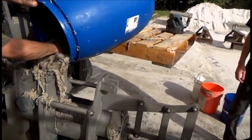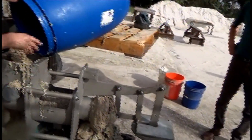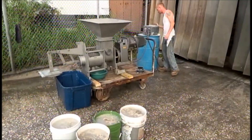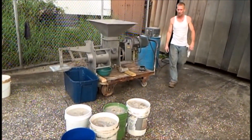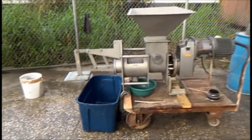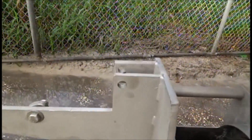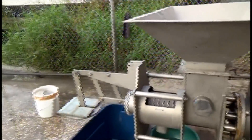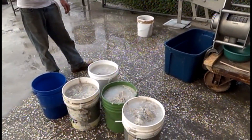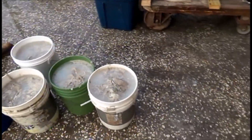That's our drum of fleshings. The screw has an eighth-of-an-inch screw-to-screen clearance with quarter-inch bars. This is the next day — the 4th of January 2017. I've got the same press here, same arrangement, except instead of an air cylinder — this one had an air cylinder at one time — it now uses counterweights. We've done some dumpster diving to get our fleshings back, and we've added water to them to see what happens.